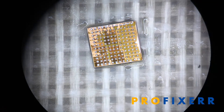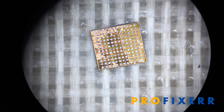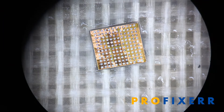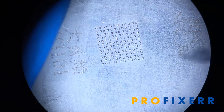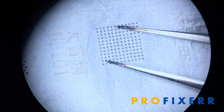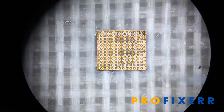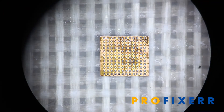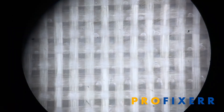The next step is to prepare the chip. After inspecting it to make sure it looks good, you want to remove the old solder and add regular leaded solder, then place your reballing stencil over the top. The reballing stencil has all these little cutouts that allow you to put solder paste directly on the pads of the chip itself. You heat it with hot air, which melts the solder paste and creates little solder balls on those pads. That way the connection between the chip and the board is through those little solder balls, and the chip is suspended so the only thing touching the board is the solder joints.